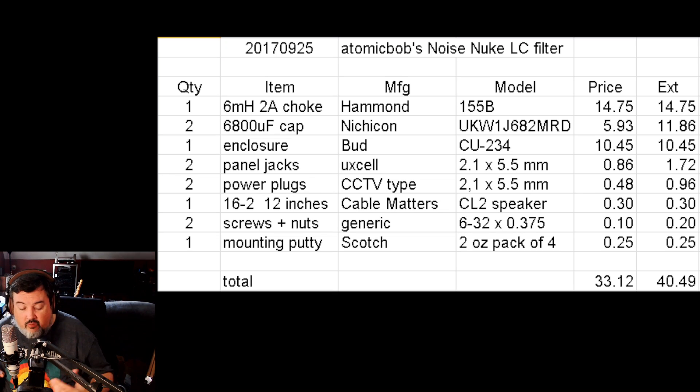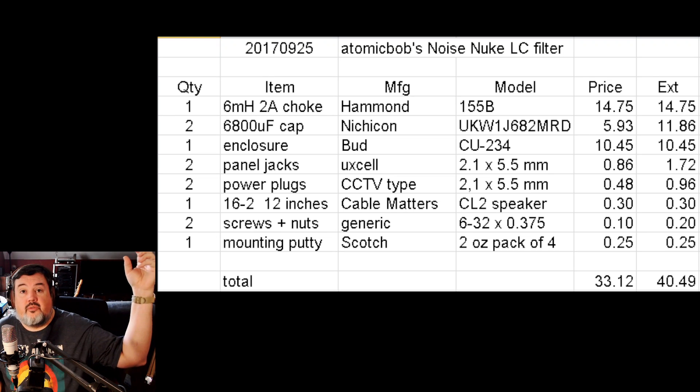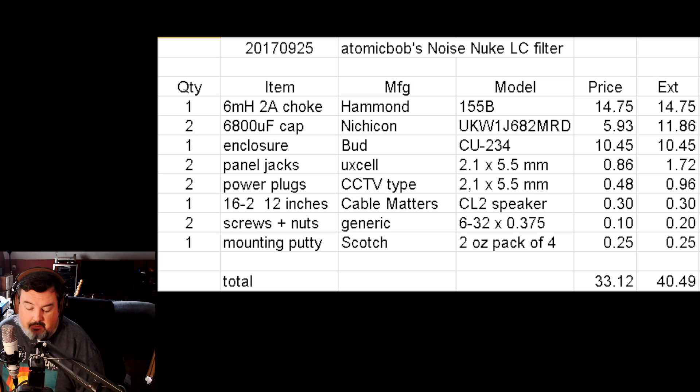This is a really cool device. Once again, I'll post a link in the description from Super Best Audio Friends. Something like this in your audio path will give you a better black background, better inner detail, and better low-end response. That filter — the inductor combined with the capacitor — takes all the noise out and gives you pure DC to work with. You don't even need power conditioners; even the dirty power coming from the wall is cleaned up. It just gives you pure DC.